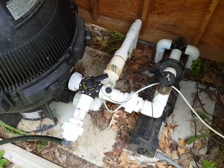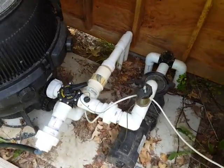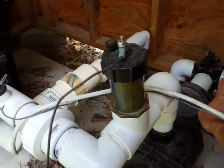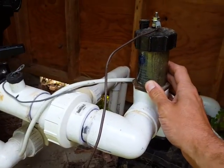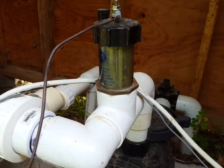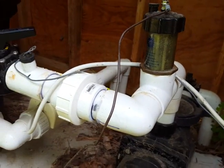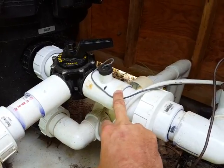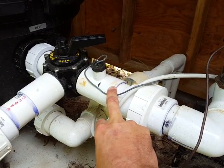Here's where it all starts. This is my pump house for my pool. You can see right here is the pump and this is where the water comes in. Then it comes up and it goes by this anode — it's called a pool tool. That's a zinc anode, and because I have chlorine and salt water in my pool water, it's helping keep the corrosion down.